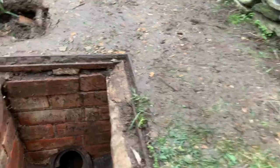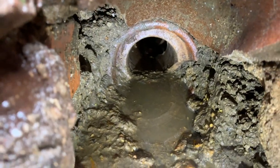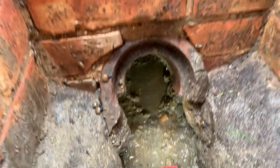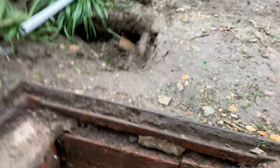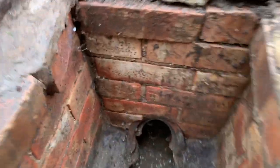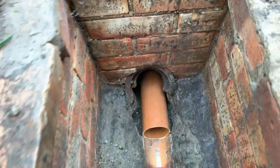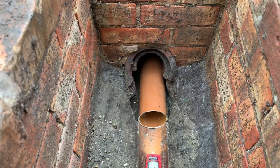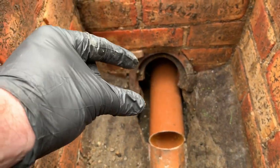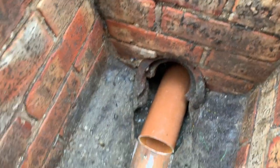We spent quite a bit of time getting this pipe cleared — there was an awful lot of stone and rubble down the pipe. But as you'll see if I push my camera in there, we've got it nice and clean and tidy. We're going to put a new piece of pipe in here — we've already cut the sides. This is the bit of pipe that's going into the drain; it's got a slight angle so it fits. That pipe will get inserted into the drain and will form our new pipe within. We'll end up joining this plastic pipework to the clay pipework with a structural liner.